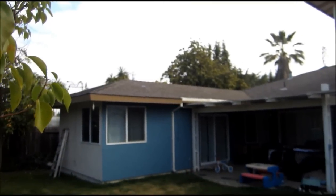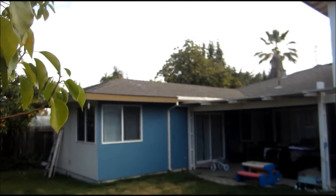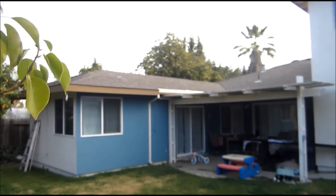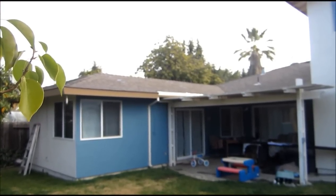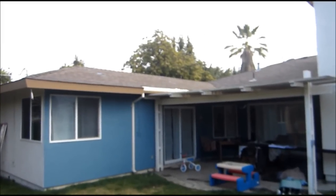I've got a south-facing roof, which is what you want, at 20 degrees — the perfect angle for my location here in the Silicon Valley. After the sun's been up for about an hour, I'm in full sun all day with no shading, with only minimal shading in the evening, which is perfect.